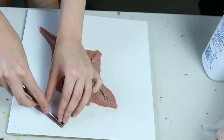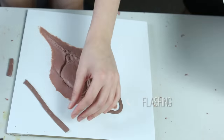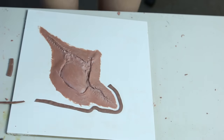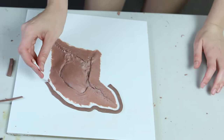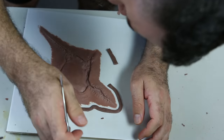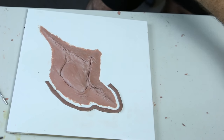The first step in getting my sculpt ready to mold into a beautiful silicone flat mold is adding a flashing around the edges. It controls how much cap plastic you have around the edges, and in this case less is best. Too much cap plastic will make it harder to apply and it will give away where your edges are, because it moves on the skin kind of weirdly and is super shiny reflective. It takes work to make it look like it's actually a part of your skin, so we put this flashing fairly close to the edge of the sculpt to eliminate too much cap plastic.